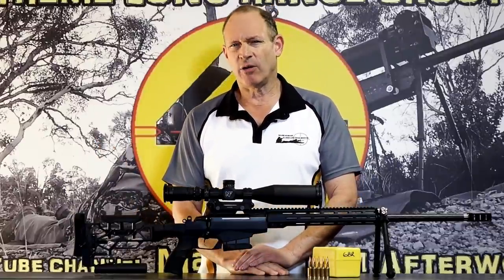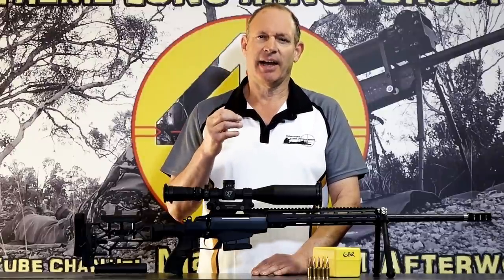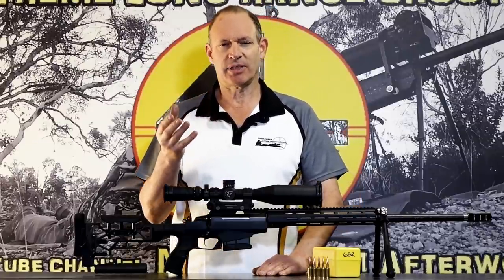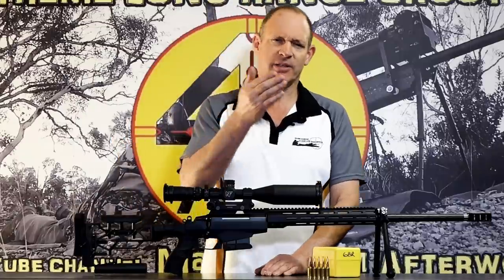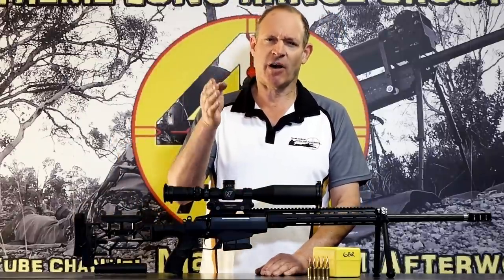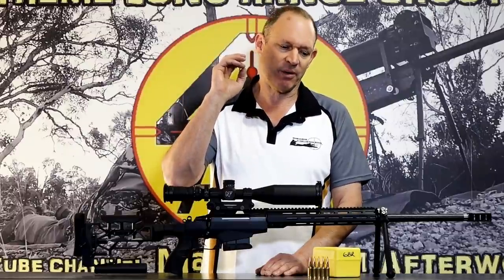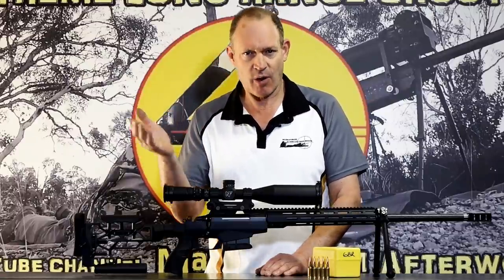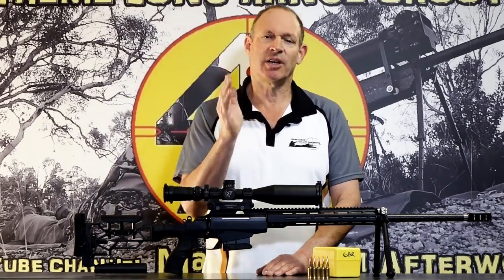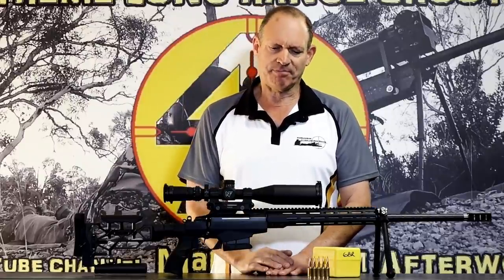But then they're set up with different strengths and different hardnesses and different thicknesses for different rounds and different setups. So especially in handguns, whether it's a magnum or just a handgun primer, you're generally going to have lighter firing pins, lighter explosions, lighter everything going on, and your firing pin setups aren't quite as neat and tidy and organized as the big powerful spring we have in a bolt. So there are generally some issues there where the primers will tend to be a little bit lighter to deal with it.